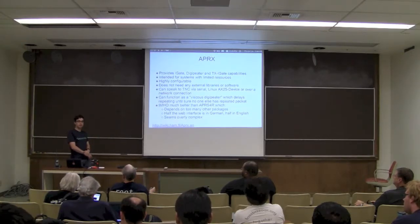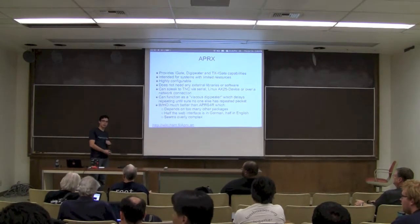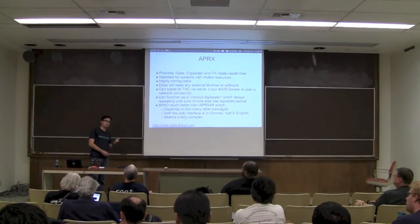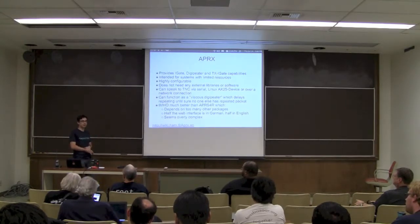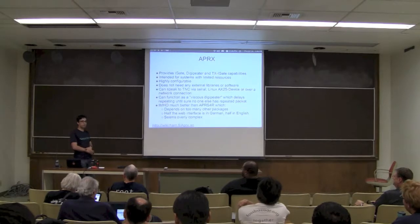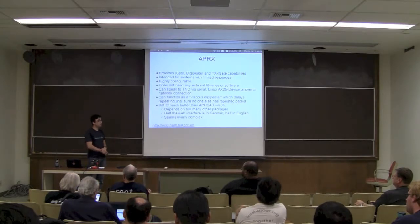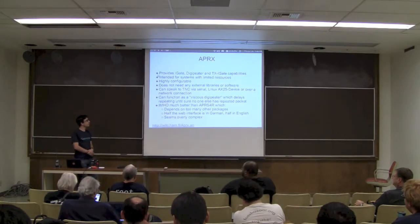system where everybody is sending out their signal on the channel, instead of an amateur radio voice repeater, which usually works where there's an input frequency and an output frequency, but not for this packet radio stuff. So there could be people clobbering each other as they're sending out their packets. So these guys came up with the idea, why don't you just store the packet and wait and see if anybody else repeated it, and then repeat it. They have charts showing it really dramatically cuts down the number of transmissions and could improve the Erlang, I guess is the measure of the channel.